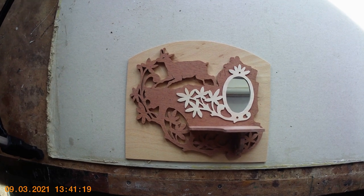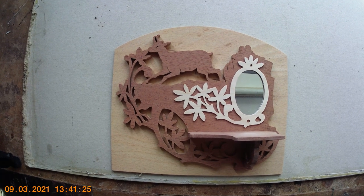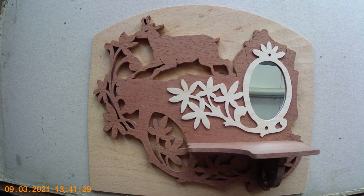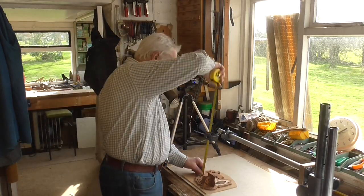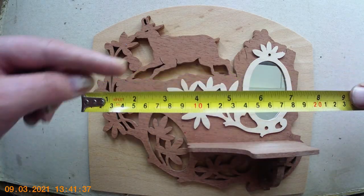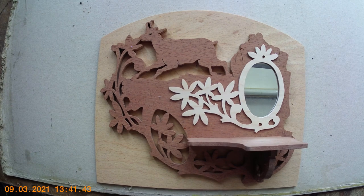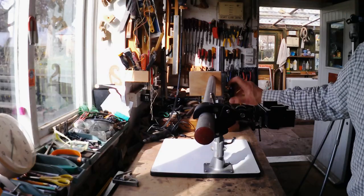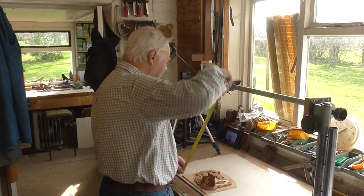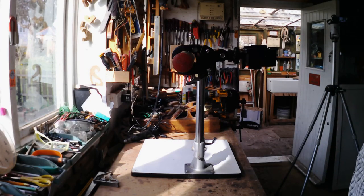For example, I'm now turning it down — it's rather like zooming without altering the lens, because it's a fixed focus lens in these little cheap cameras. I've gone down now to within about 9 inches — so that's 9 inches from the lens to the work, which is pretty good actually, and I'm hoping that's still in focus. Likewise, I can turn it back up as far as it'll go, right to the top, and now I've got a distance of some 20 inches between the subject matter and the camera lens.